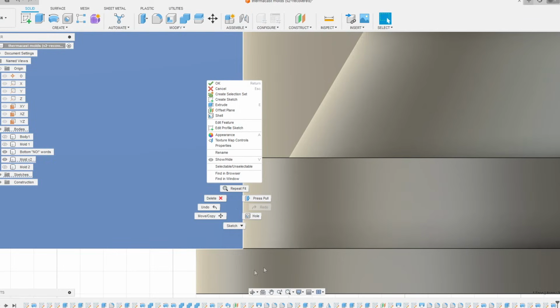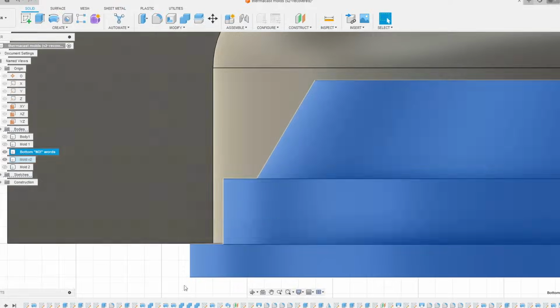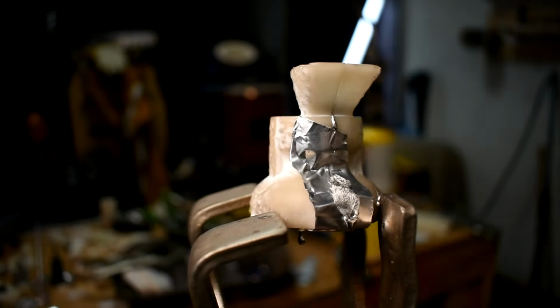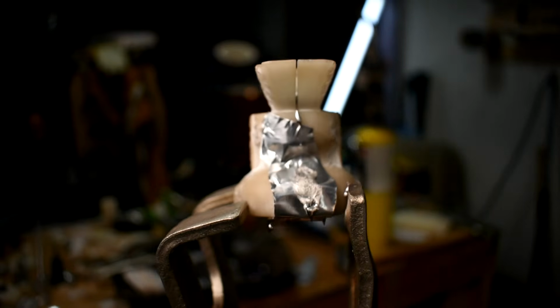These are designed to fit tight, and then I printed them a few percent smaller because when they go together, they're gonna be a little bit too tight, right? And with printed stuff, I usually say like 0.2 of a millimeter is a fair amount. You wanna go small enough that it will fit together without binding and you can actually clamp everything together, but not too small that it leaves a gap large enough for metal to flow through. What that is exactly, I'm not certain, but 0.2 of a millimeter seemed to work. Try that. You can actually plug up holes with aluminum foil tape. So if you put all this together and you see a little gap, wrap it in aluminum foil tape, that seems to work.